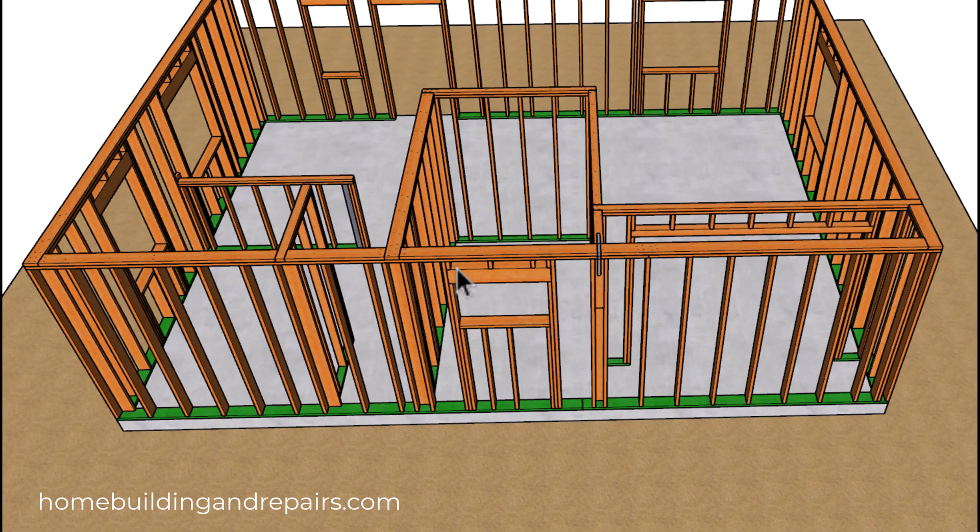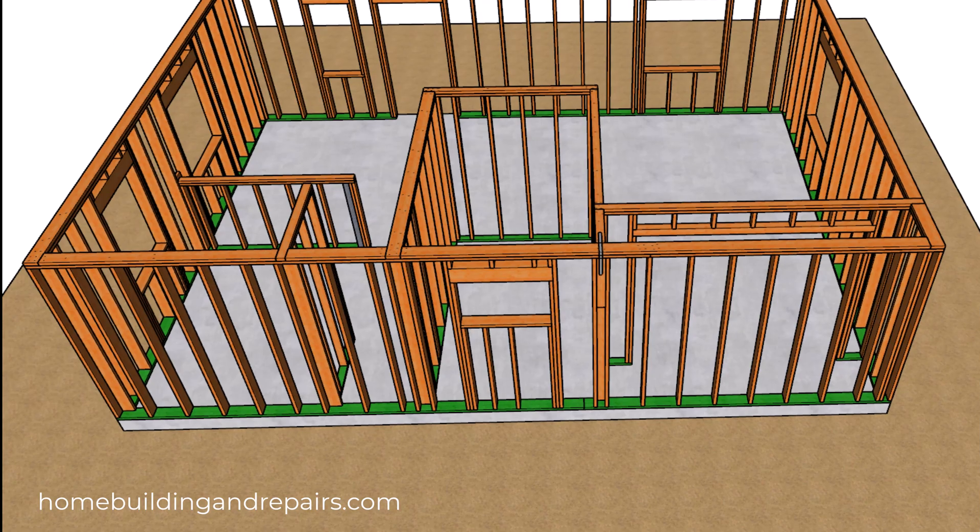You can see where the lower wall framing plate goes all the way over to here — I would just need to extend it somehow. If the distance is more than eight feet I could have a plate break in the center, with four feet on each side. Then I could have a plate go all the way over and extend the upper top framing plate to get the connection, just like I did here.